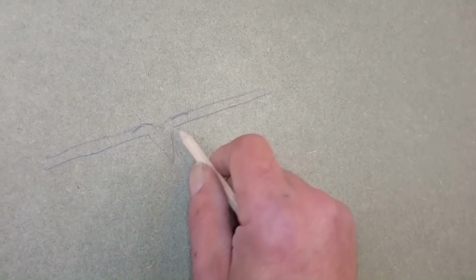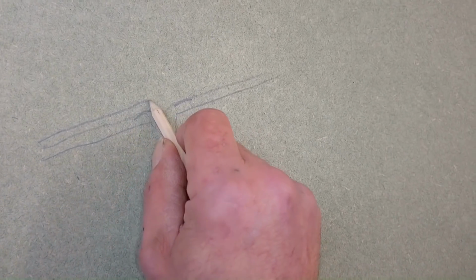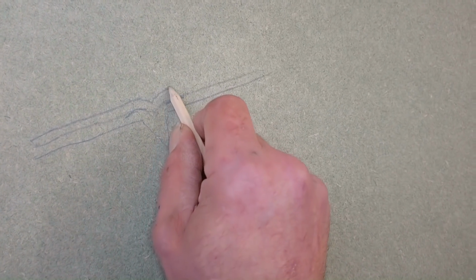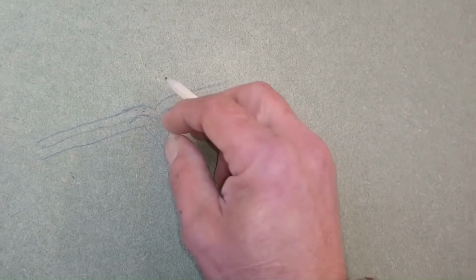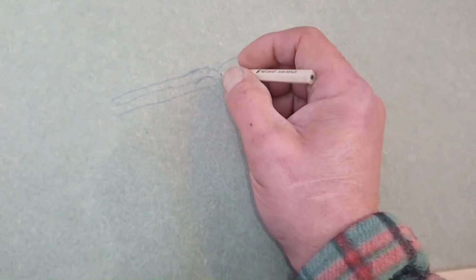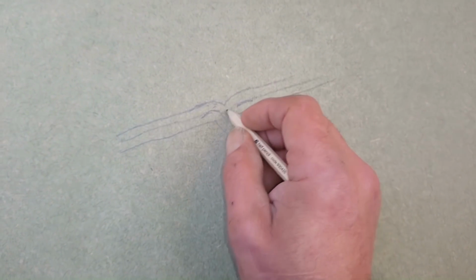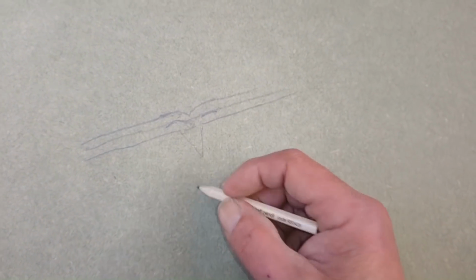And you think, oh, I'll put another coat on, that'll fill it, but it doesn't. Your second coat does that, and it actually gets worse, you know, the hole gets wider. I think it's surface tension, the paint sort of peels away from the hole. So what you have to do is fill it, either fill it to begin with, or fill it on your first coat.